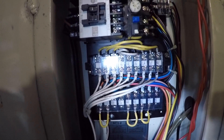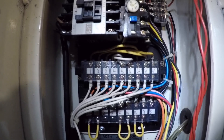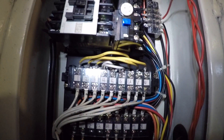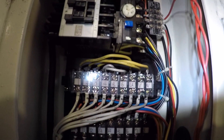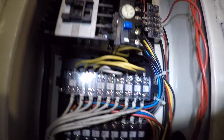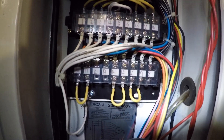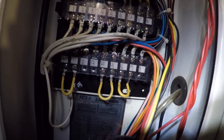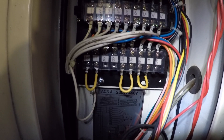I had to switch the jumpers from 460 to 230. You see this terminal block at the top — positions 1 through 6, labeled U, V, W. The manual will tell you what the top jumper wires need to connect. The bottom terminal block is easier to see: terminals 10 and 11 are jumped, 14 and 15 are jumped, and 16 and 17 are jumped. That's what I had to do to change from 460 to 230 volts.